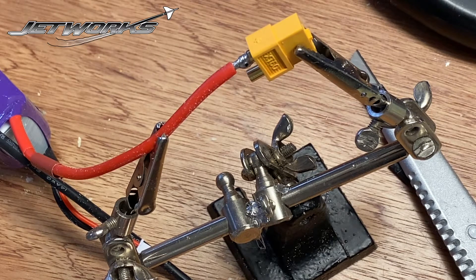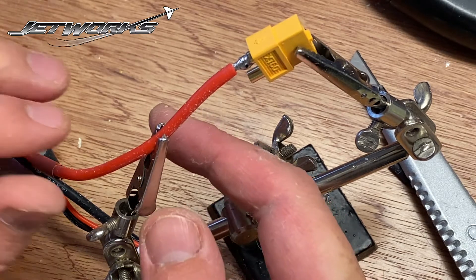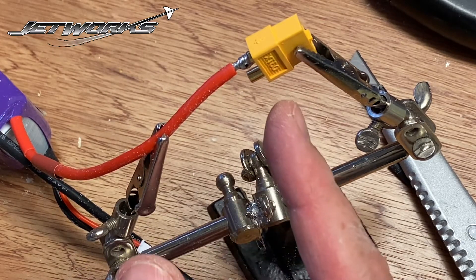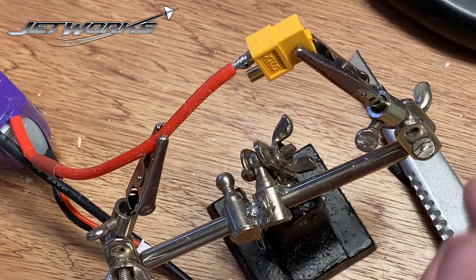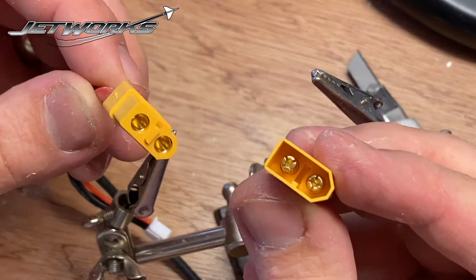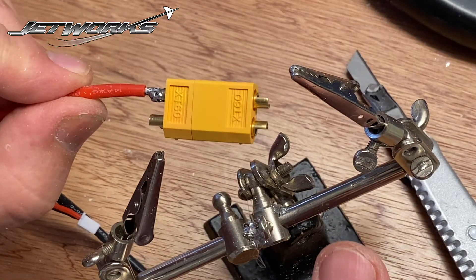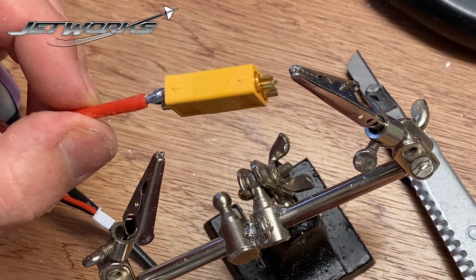You let that cool. It takes a while to cool some of these because they often heat up the brass contacts. And if they do that too much, then the contacts within the plastic moulding of the plug can actually distort. One way to avoid that is to get the opposing plug and plug them together — it just holds everything correctly aligned when you're soldering. It gives the extra support needed so the plastic doesn't melt and move.